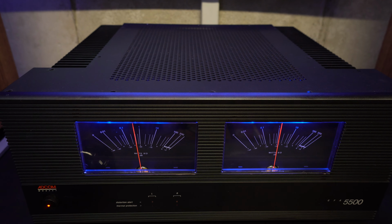The other thing that I did that is important is you'll see that the needles are glowing a nice bright red. That was something I had to do, because the needles that came with these meters were white, but they didn't reflect or collect light at all. They were a glossy white, which just isn't going to work. So I took some highly reflective, semi-fluorescent red ink and inked the two needles. Now, as you can see, they really catch the light from the LEDs and really jump out at you. You could see them from across the room.